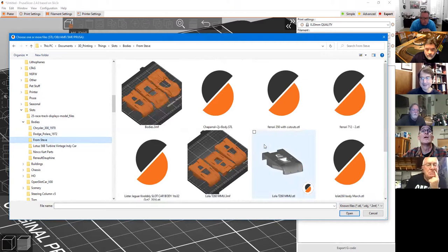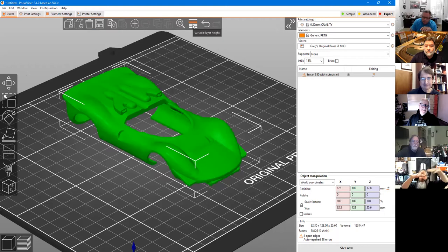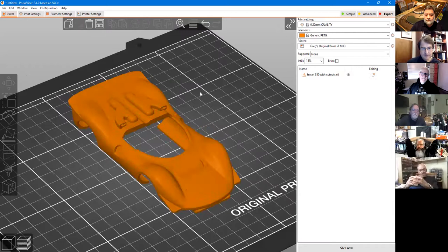If you're using Cura, if you go into experimental features and look for adaptive layers, that's where you can set, like Greg was talking about, 0.3 versus 0.8. Yeah, okay, there you go. Adaptive layers. Thank you. There's the 350, yep. So Bill was asking what that feature is called.